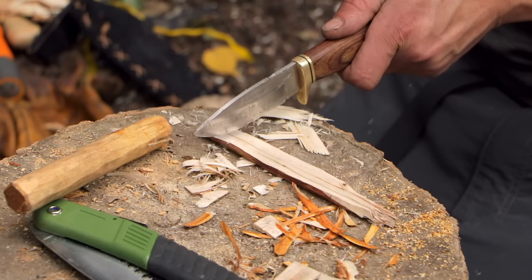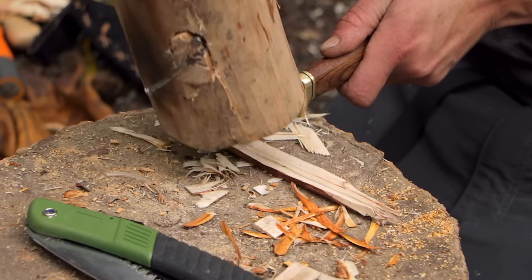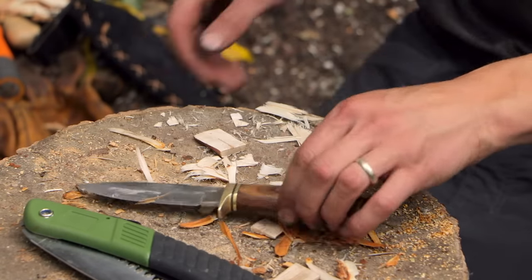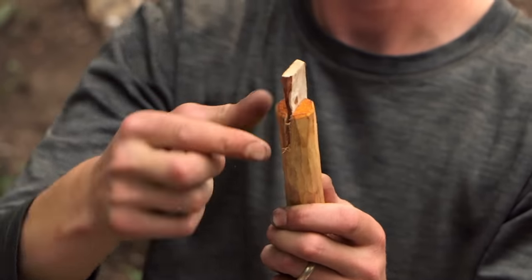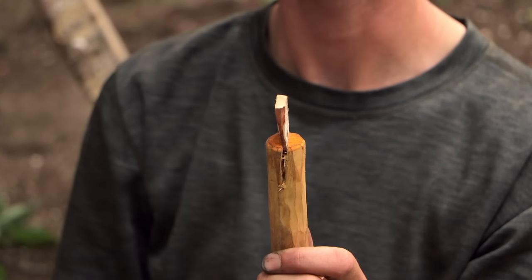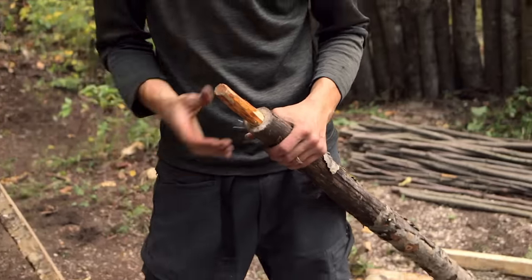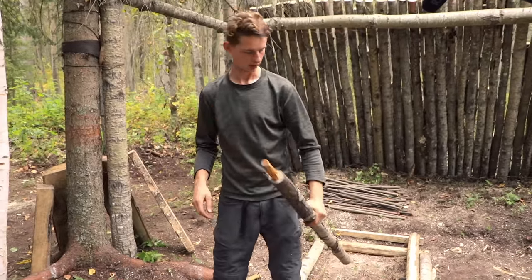Our subscribers shared with us a really useful tip for when you want to put a dowel into a hole and wedge it from the inside of the hole where there's no access because the hole doesn't pass all the way through the wood. Ruben's going to show you exactly what that means right now. Nice. It's a good size wedge. Put a cut so that you can put the wedge in. As the wedge gets driven in, it spreads out and seats itself, tightens it into the hole. Nice. Is seated. And that is tight. Holy moly. That's awesome.